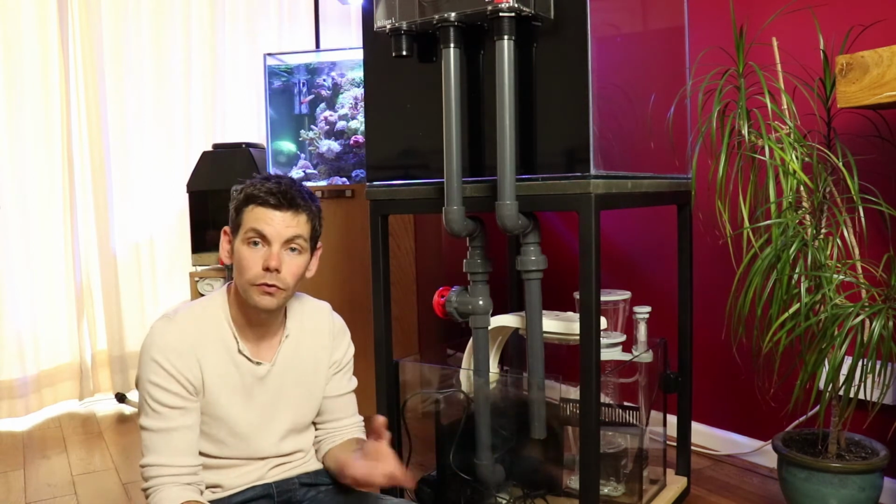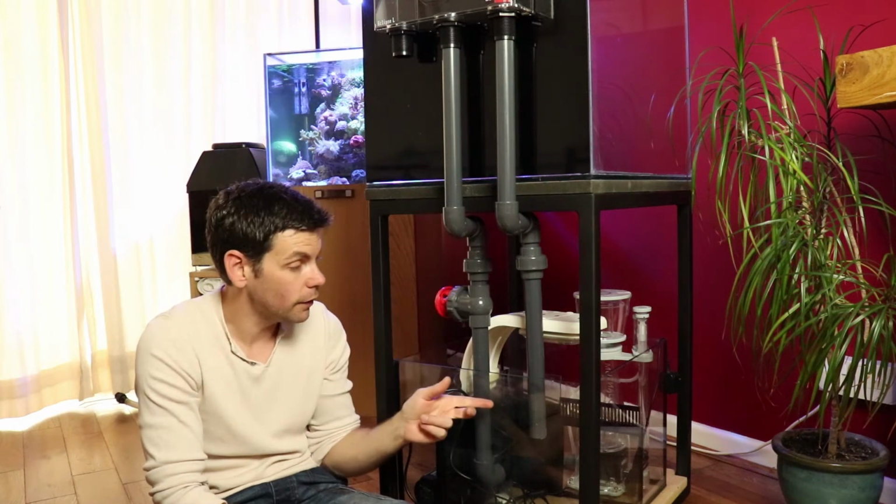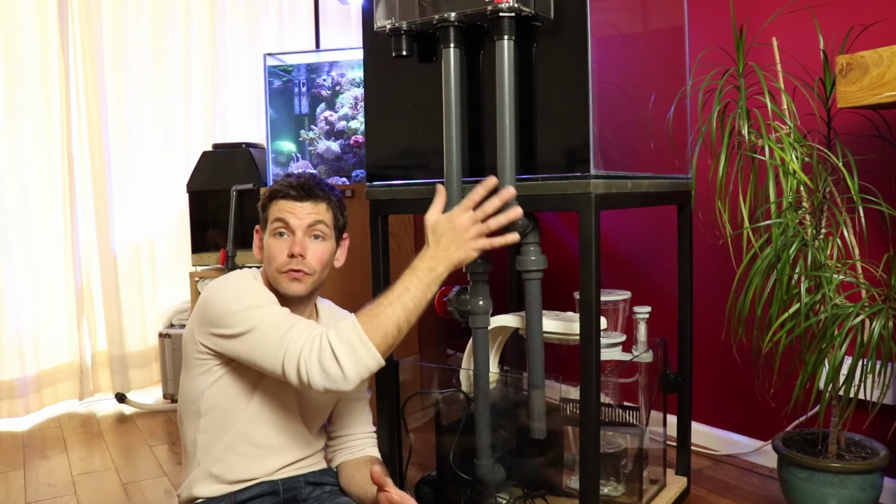If you had that below the water level line and it wasn't making any noise, you'd be unaware that there was an issue with the gate valve and the primary drain, and it could be weeks before it's brought to your attention. So that's pretty much it for the drain lines.